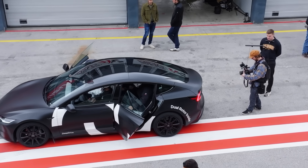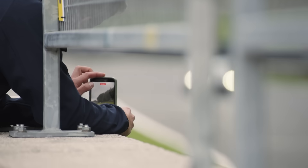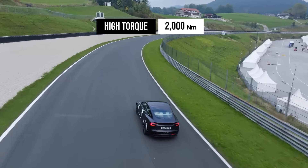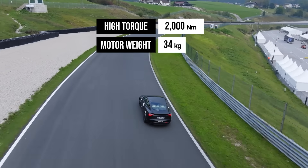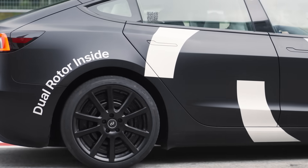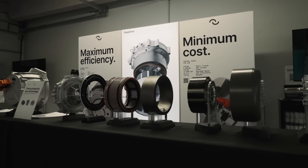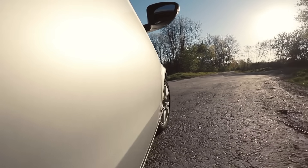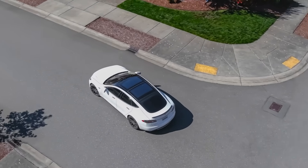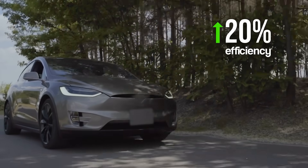People who have participated in DeepDrive's test drive have also been very positive about the handling and performance. For those who love the numbers, the performance figures speak for themselves, with a high torque of over 2000Nm in a package weighing just 34kg and a peak power of 180kW. With all the power going directly to the wheels, this minimises losses and reduces the number of components, potentially making the vehicle cheaper too. The yokeless design also improves efficiency at low torques, and because cars often operate at low load in real-world conditions, this could improve overall efficiency by a stated 20% across a real drive cycle.